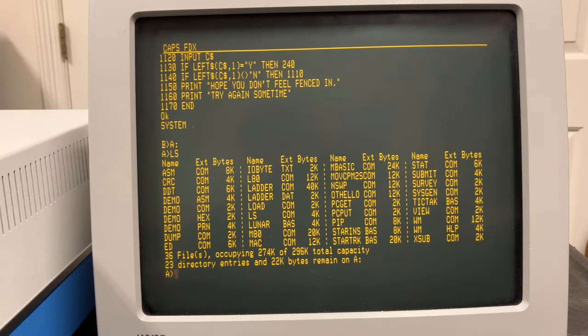All right, so yeah, good feel on all this. Again, at 76.8, it's a very nice system. Now, 76.8 is not a standard baud rate, oddly enough. The baud rates doubled for a long time. They go 300, 600, 1200, 2400, etc., 9.6, 19.2, 38.4. 76.8 would be next, but it's not. At that point, the standard baud rates take a one-third jump and go over to 57.6. And then 57.6 doubles to 115.2, that doubles to 230.4 or somewhere along those lines. I think I got it.